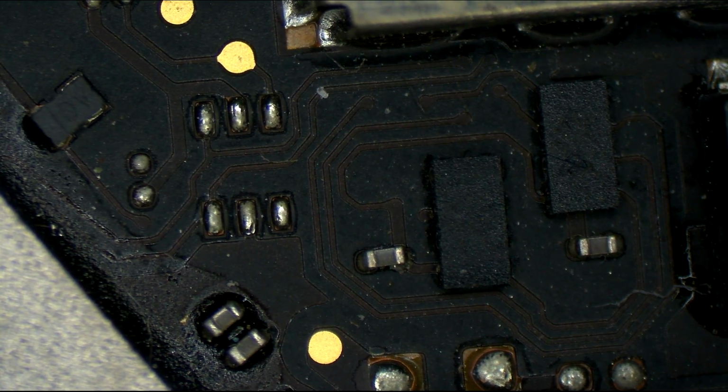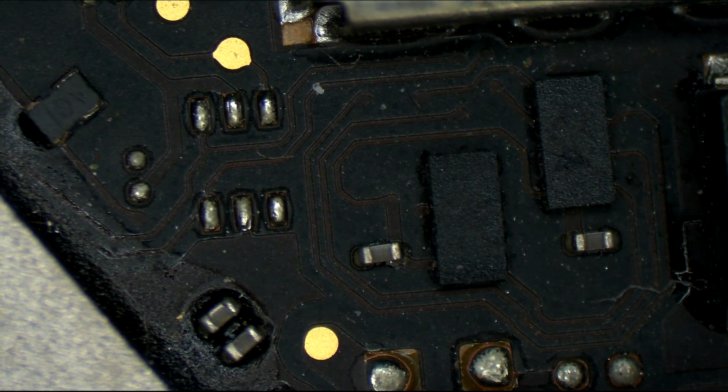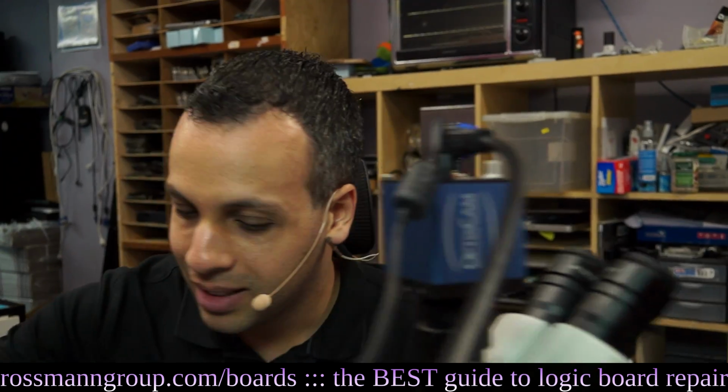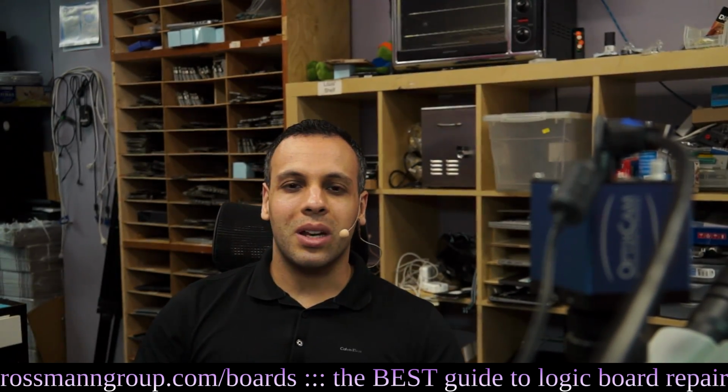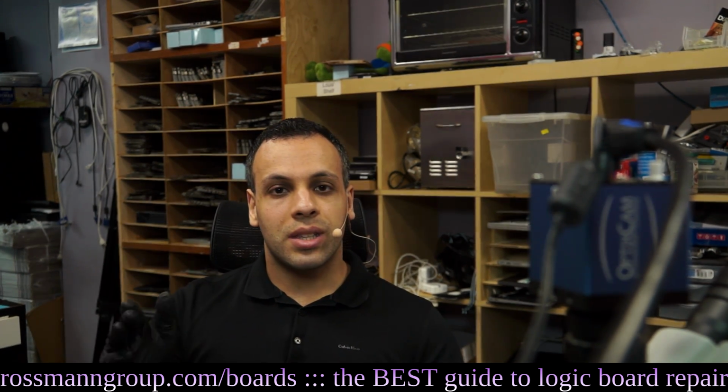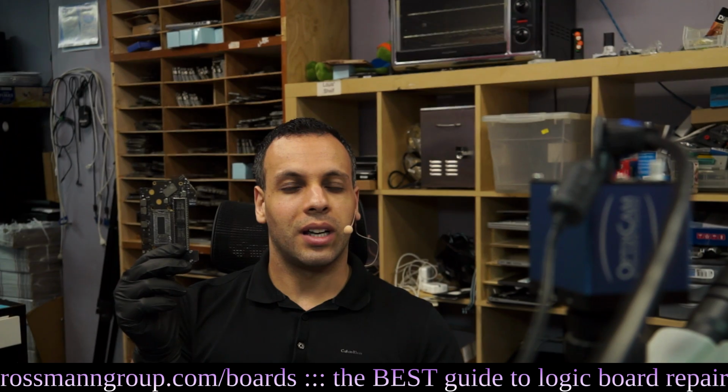Yours is a soldered on Wi-Fi chip too, right? Yeah. Does it have a sensor chip next to it? There's a bunch of missing stuff there. All right. The donor board does not have it. All right, so the donor board doesn't have it either. So what's really important here is that it's working quickly. It's not lagging. Now, the computer does think that the airport card is 129 Celsius.